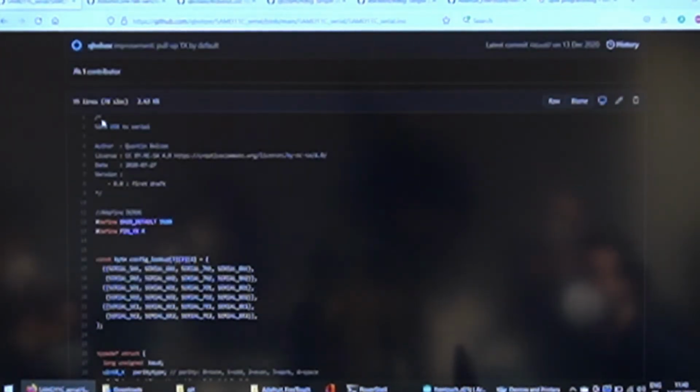But the other thing it's doing is constantly checking the configuration for your USB port. So you can dynamically change the baud rates, the parity bits, the stop bits, and even the data bits. I didn't know that, but the serial protocol supports more than 8-bit words. It's interesting. Anyway, let's have this code. I'm just gonna copy paste it. I'm lazy.